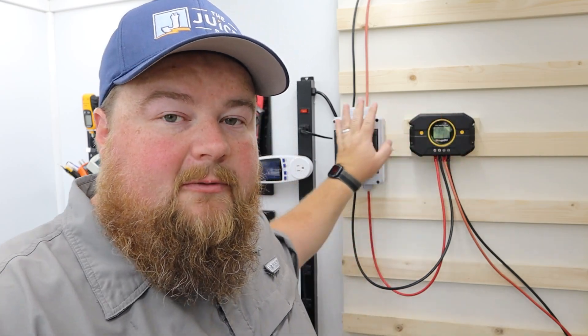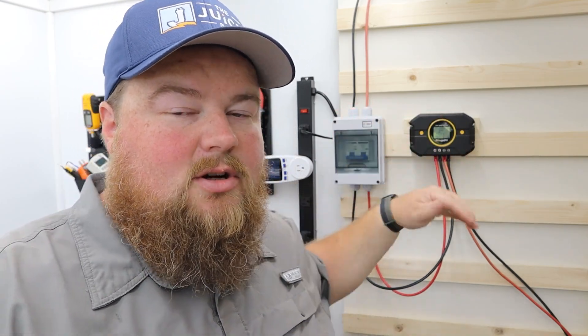Taking the user manual as reference, I'm going to set my battery type in the charge controller before I turn on my solar array and start charging anything. This charge controller handles a wide variety of batteries: sealed lead acid, absorbed glass mat, gel batteries, flooded lead acid, lithium iron phosphate, ternary lithium batteries, and lithium titanium oxide are all listed as battery compositions this controller will handle.